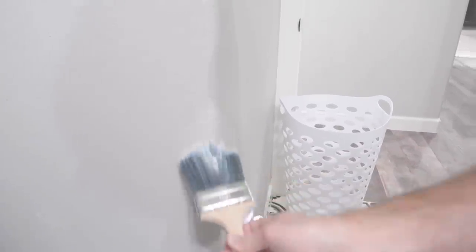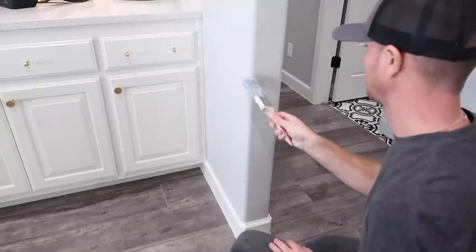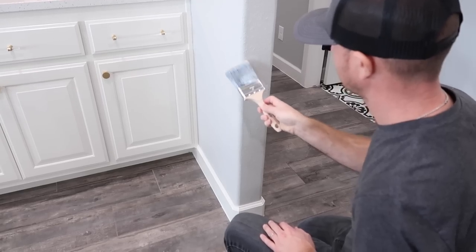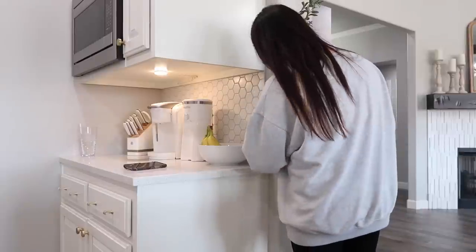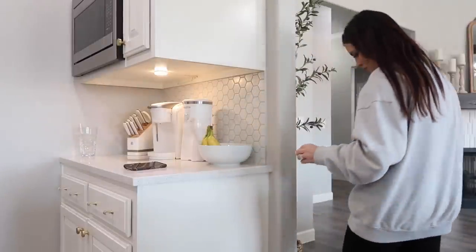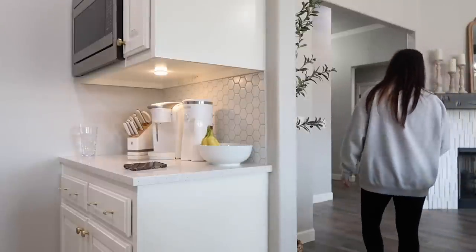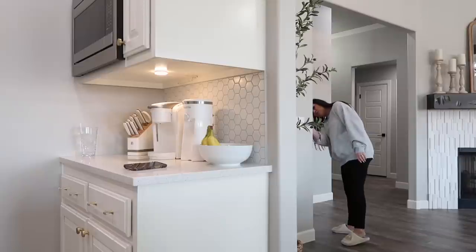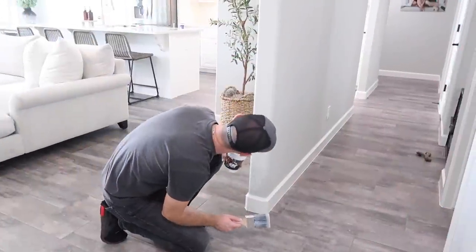Now, when we are filling holes and painting and touching up, I do not paint the whole wall. It would take us forever if I had to paint all the walls in my house because I touched up a hole. So try your best just to have whatever leftover paint is, or try to get the exact same color of paint. And then be sure just to feather out, because even if you have the same color paint, if it's white, it may have yellowed a little bit, or the paint could be dirtier on your walls or faded. So just do your best to put a little bit of paint on it. So use as little paint as possible to cover up those spots, and then feather out so it's not just this circle on your wall. It blends into it, if that makes sense.